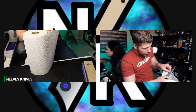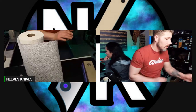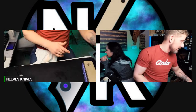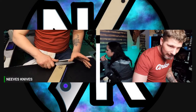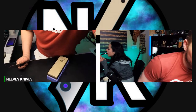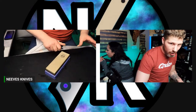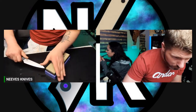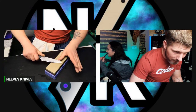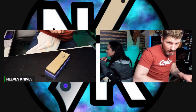So I can hit the entire edge of the blade on the stone. But also, it's because of what I was saying, that when I'm moving, I'm locking my wrist and I'm using my body. Sorry, I got to lower you guys. If you watch my body, I can go across like this and it's comfortable. I'm using my hips to just move across. So my edge is on here. My wrist is locked. When I want to get to the tip, I'll lift my elbow. But to go across the stone, I'm just using my hips, going back and forth.